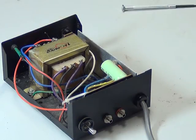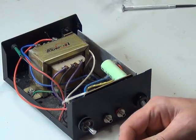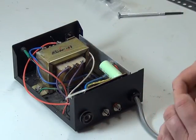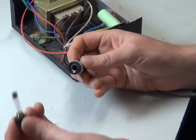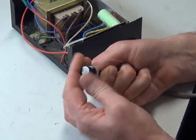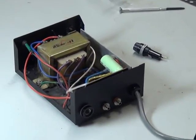Now, if I throw across one of those fuses to you, you'll be able to show the camera. And I hope I've ordered the right ones — they are captive fuses. So you pop the fuse in there, and when you take that one out, it comes out with the holder. It doesn't leave the fuse behind. So we're going to be changing those electrolytics, changing that fuse holder, and then we'll come back with a finished product in a moment.